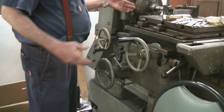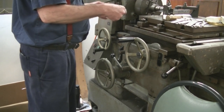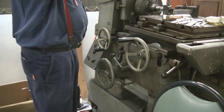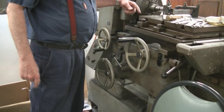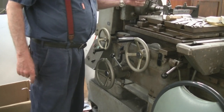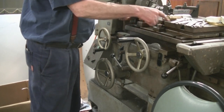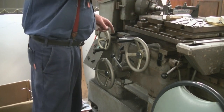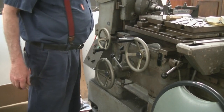Any little job like this, there's no need for a vise. Just drop it onto the table, a couple of toe clamps, and away you go. But I can also mount a boiler that's 3 metres long. I've got no height restriction. The only restriction is the work envelope, which from memory is a 12-inch, 300mm cube. You can work 18 inches with the table. These toe clamps here lock the table dead in at 90 degree intervals, and the top table rotates, and it's also marked off in degrees here. So very, very universal machine.